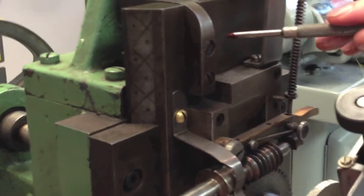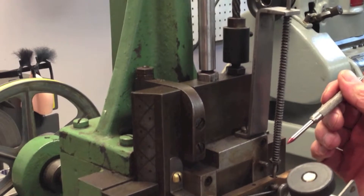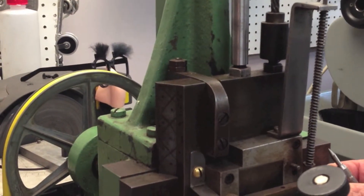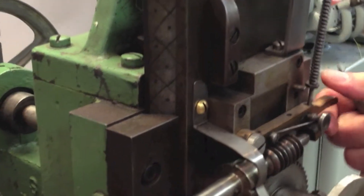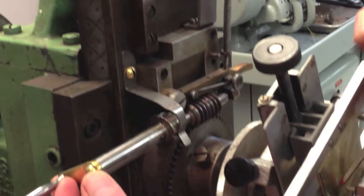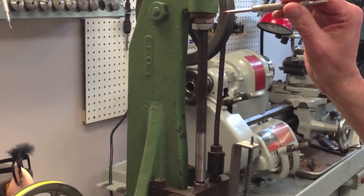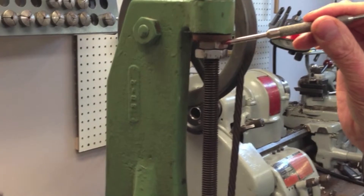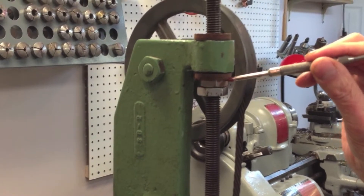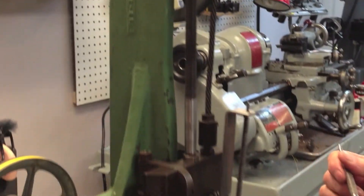If you look at the base of the machine right here and up here with the weights in the middle, you'll notice it is very much a small straight-line machine, but it takes no pattern bars. This is a spring-loaded stop here — you use this to set up the machine. I have this particular cutter on the true center line of the machine. When you're doing sun rays, you have to set a stop so that every time you come back you always go to the center line of your machine and the center line of your part. It's very easy to set two stops for this job; it only takes about 10 minutes.